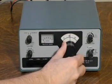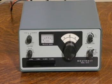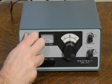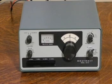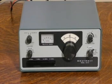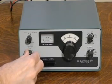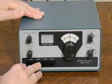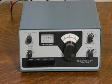The dial has a pretty good feel to it, though it's a little tricky to tune single sideband signals. Because it's a direct conversion receiver, you'll hear a signal on both sides of the center frequency. You need to use the upper frequency to ensure you're transmitting on the center frequency. The manual suggests tuning the band from high to low. Selectivity controls the active audio filter with wide and narrow settings. Narrow is good if there's interference from stations near in frequency to the one you're trying to listen to. Loading is adjusted during transmit to match the antenna, as indicated by a peak on the meter. The meter indicates relative output power and is not calibrated — it's not a receive S meter, although there are mods for this. There are four push buttons for band switching, which is solid state and mostly done using diodes.